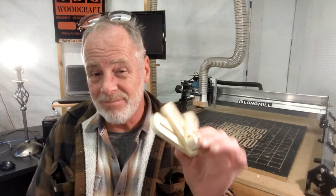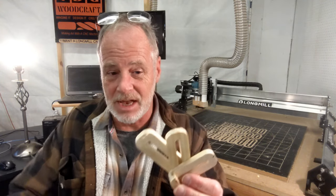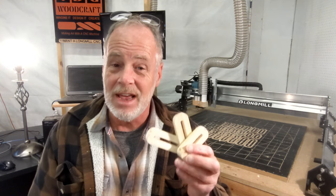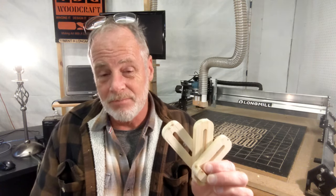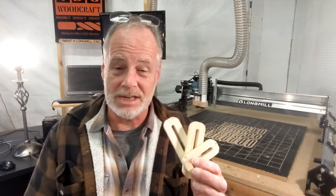And on top of that, I prefer soft clamps, like out of pine or plywood. When you buy clamps for your CNC router, you're usually paying $50 or more for a set of four, and they're usually made out of a hard material like steel — and steel and your router bit don't get along too well. Inevitably, somewhere in your CNC journey, you are going to run into your clamps, and your CNC router bit is what's going to give.